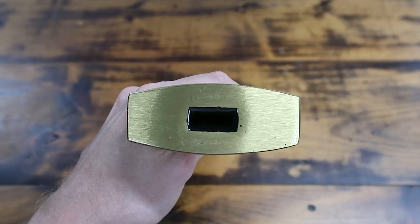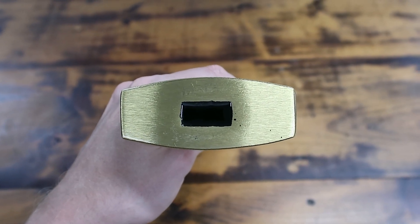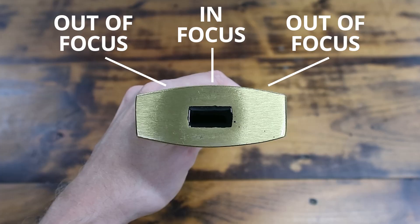When I bought this mallet specifically for this video demo, I thought the side of the brass head was completely flat — instead, it's curved like this. I really wanted to do a full end-to-end engraving to show its capabilities. However, since the hammer tapers down on both sides, if I focus the laser on the center where this Viking character is engraved, the laser would be far out of focus by the time it travels to either end of the hammer. Yes, this would be a problem with most lasers out there, but you do get a little more wiggle room with longer focal lengths. For example, if I did this on my 60-watt fiber laser, I don't think it would be an issue at all. So keep in mind: if you buy this module, make sure you are double and triple checking your focus before running a job. But it wasn't nearly as bad a process as some people are making it out to be.